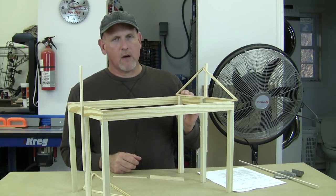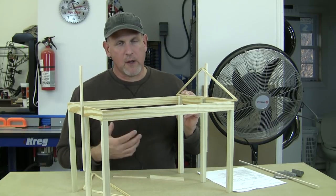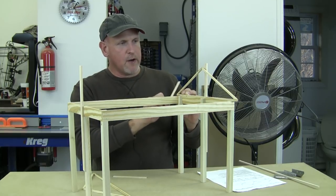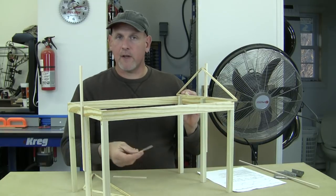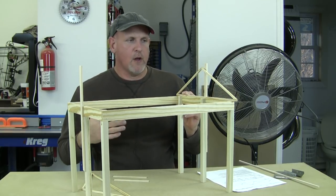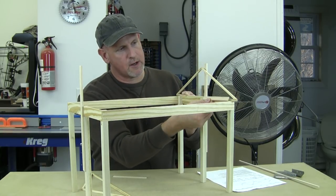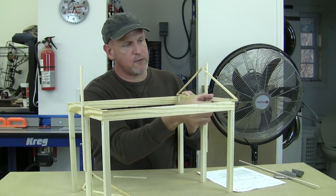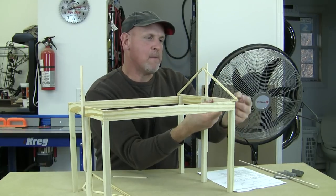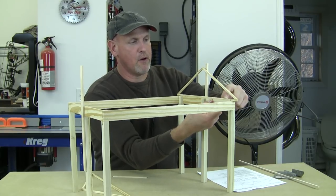At that point there's a lot of beating and banging and hollering that's going to take place. You've got to beat this thing into place so you're lined up on your band. I have an overhang of 14 and a half inches — that way it's 16 inches when I put the fascia board on. These guys are calling out measurements, hitting it over here, beating it a little bit, until we finally get it. At that point we just went ahead and toenailed it right there. There's not a whole lot of nailing surface along that band, so we came in with a 2x6 and scabbed it in on the inside of that band. That gave a surface we could nail that truss to, and we nailed it on both sides, so that truss is really nailed secure on that side band.